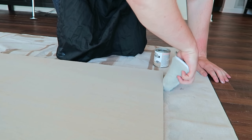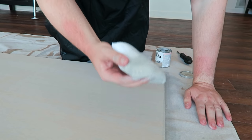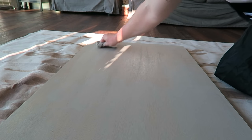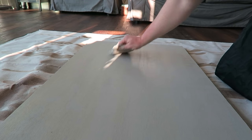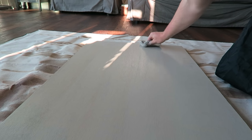The stain takes quite a bit of time to dry, but I wanted to get the first coat on top first. I'm doing two coats — let that dry, then do the edges. I won't stain the bottom. It's natural to get a little stain on the top when doing the sides, which is why I'll go over it again. We wanted a little extra stain so the wood grain comes through — mostly a bleached, sandalwood color.